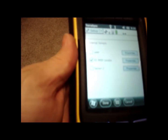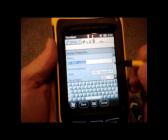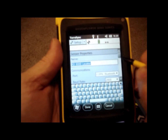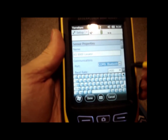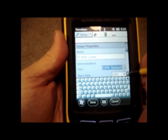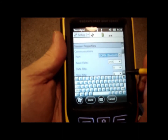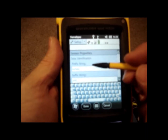There are three external sensors you can select. Right now there's one called Laser, one called Sensor 1, and one called Sensor 2. I'm going to change Sensor 1 — I already changed it, but I'll show you what I did. I went to Properties and relabeled it RD8000 Locator. Underneath the port number, we want to select COM9 Bluetooth. There's COM1, COM3, and then COM9 Bluetooth — that's the Bluetooth connection to the receiver, and that's what we're going to use. The baud rate should be 2400, data bits should be 8, stop bits should be 1, and parity should be none.